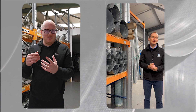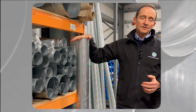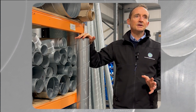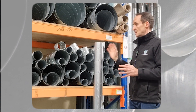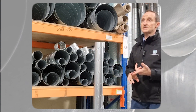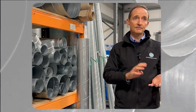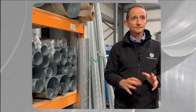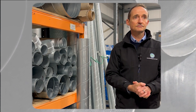Are you able to transfer food and liquid through the spiral? Galvanized is not really suitable for liquids or steam. But if you wanted to transfer food through it, we do a whole range of stainless in the same format — all the fittings in stainless. We do two grades: 304 and 316, which is food-grade stainless used in the food industry, clinical, and pharmaceutical settings, and it can be cleaned and washed down without any problems.